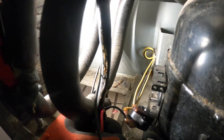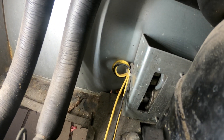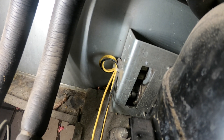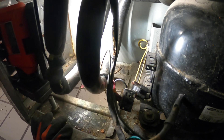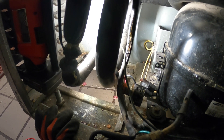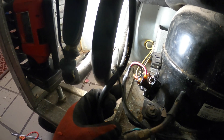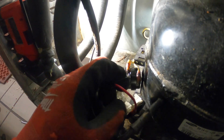These four wires here are definitely our power wires. Those right there actually go to a series of capacitors — in that little casing, the one on the bottom is a run capacitor and the other is a start capacitor. We honestly don't exactly need them. We're going to try it without the capacitors first; if we have a problem, we'll incorporate those.